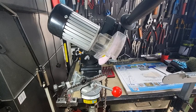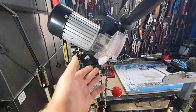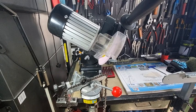The brown resin bonded wheels are much better — a little bit more expensive, but they run cooler and give a better surface finish, especially at 100 grit. Bear in mind, you only get what you pay for. If you're going to use hand files, are you going to use the cheapest files? I don't think so. The brown resin wheels in 145 millimeters aren't the easiest to come by, but the 105 millimeter wheels I can get quite easily. Anyway, I've got 17 different things listed, so we'll go through them.